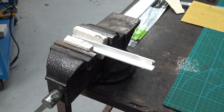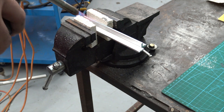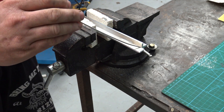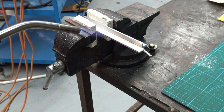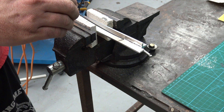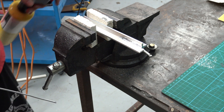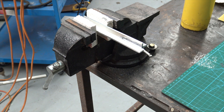We'll give it another go and see what happens. I've got MAP gas again, the same canister as last time. If you look closely it actually starts to work a little bit, but it's still too cold. I heat it up a bit more and at that point it just goes in buttery smooth — I was having success and it's actually working. I was very surprised compared to last time. The rod did work for a little minute and then stopped, so I still have a few heat issues going on.